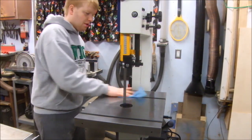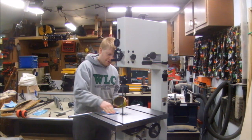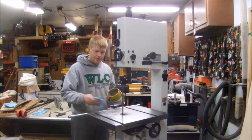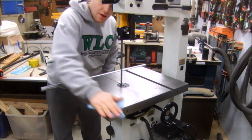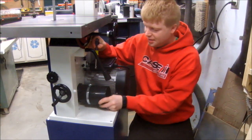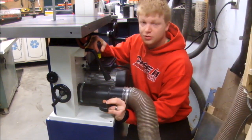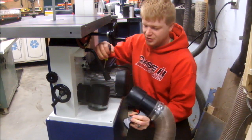The protective oil on the table needs to be removed. I replaced it with a coat of paste wax — just put it on, wait a few minutes, then buff it out. It works great. On the back of the unit there's a 4-inch dust port, so I'm going to attach an adapter to hook into my system. This is the Rockler Dust-Rite dust collection system.